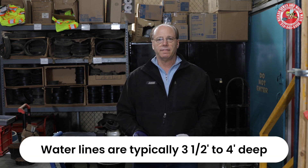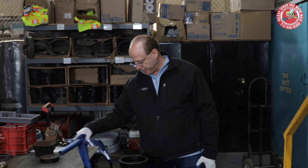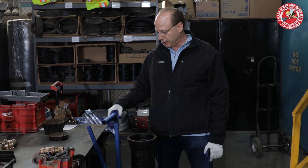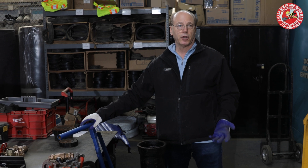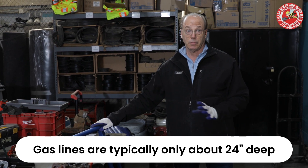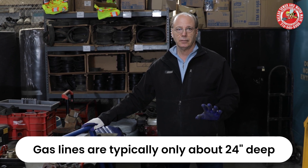So in New York City, a typical water valve top would be approximately four feet deep — could be four and a half, could be three and a half. So when you put the key in, it's going to go down all the way. This is a curb box key for a water valve — about three and a half feet, but it has extensions. Now if you put a curb box key in and it only goes down about 18 inches or two feet and the box isn't labeled, I wouldn't touch it, because it's probably your gas line. That's a key thing to keep in mind.